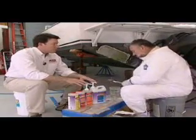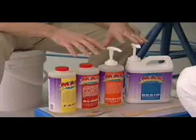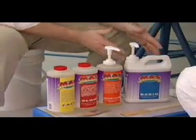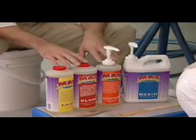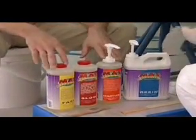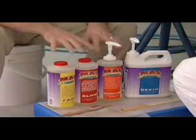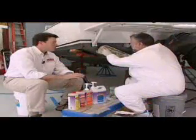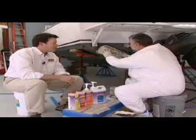It is. We've calibrated the pump so it's one pump to one pump. But it's not necessary to have the pumps as the ratio, the system is 2 to 1. 2 parts resin to 1 part hardener. And as you mentioned, we can blend the hardeners. But you never change that ratio. It's 2 parts resin, 1 part hardener. So you made it for a dummy like me. Yeah, well, okay. Me too.